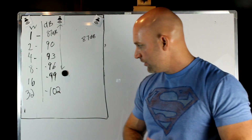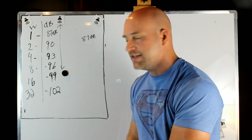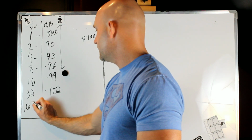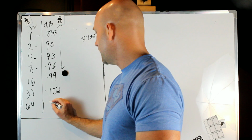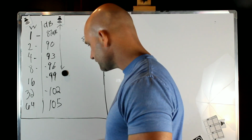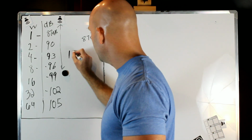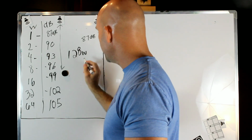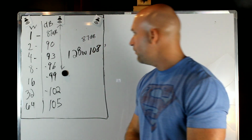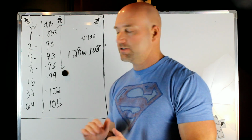Now notice we've got 32 watts and we're almost at reference. If you listened at 5 dB below reference, you only need peaks of 100. That 32 watts is going to give you that, and you're going to have a little headroom. Let's go ahead and give it 64 watts. And we are at 105. All right. But of course we have no headroom, so we need to double it again to 128 watts, and that would give us 108. Plenty of headroom. So now with a more sensitive speaker, this was a 95 dB speaker, we're able to get much louder with much less power.